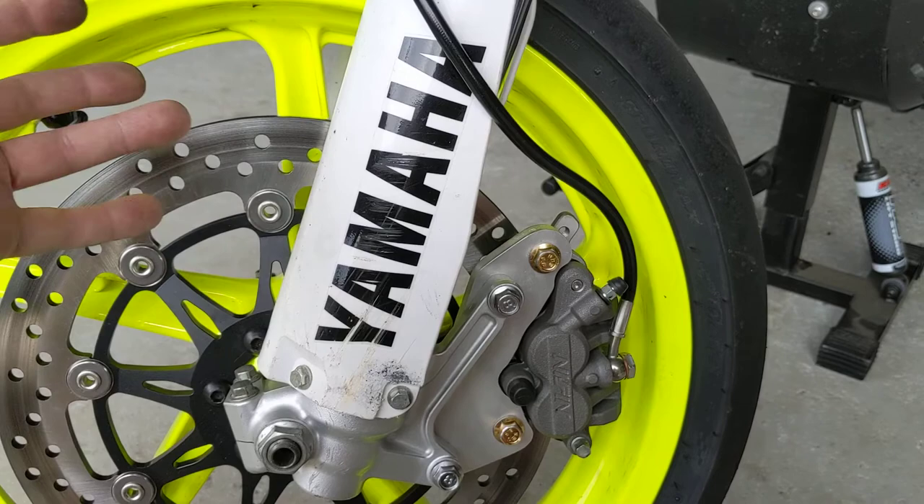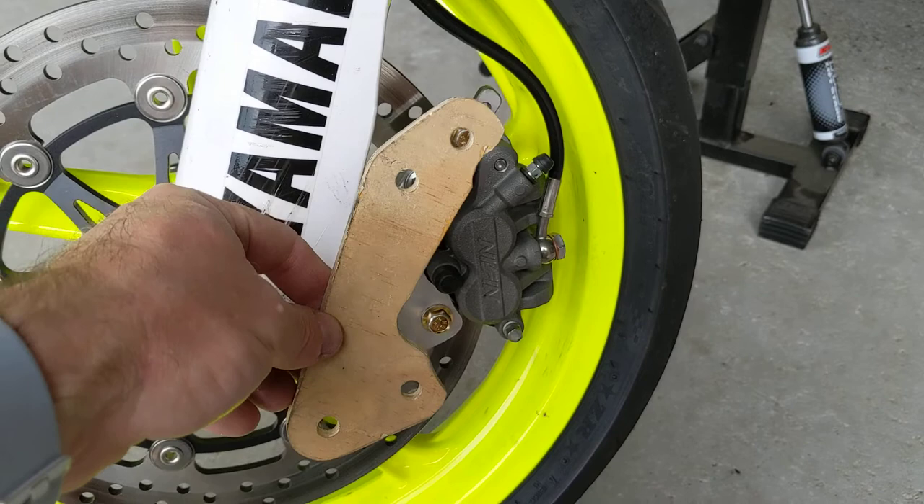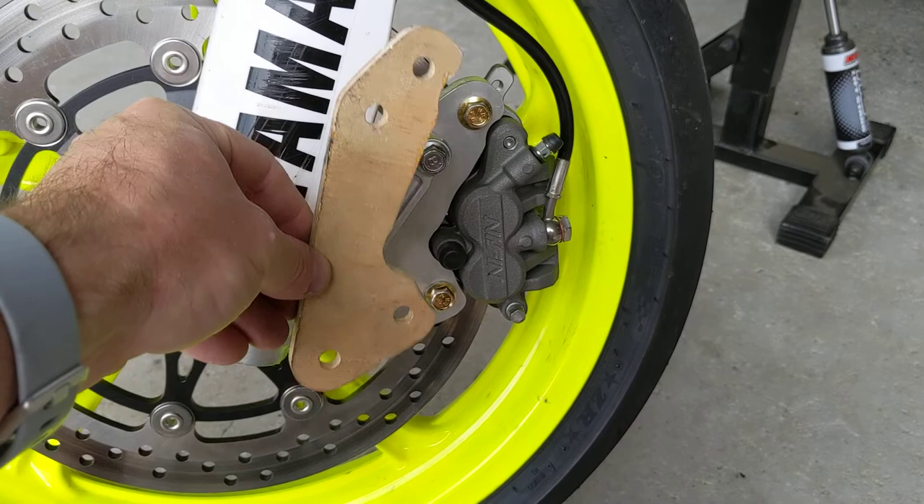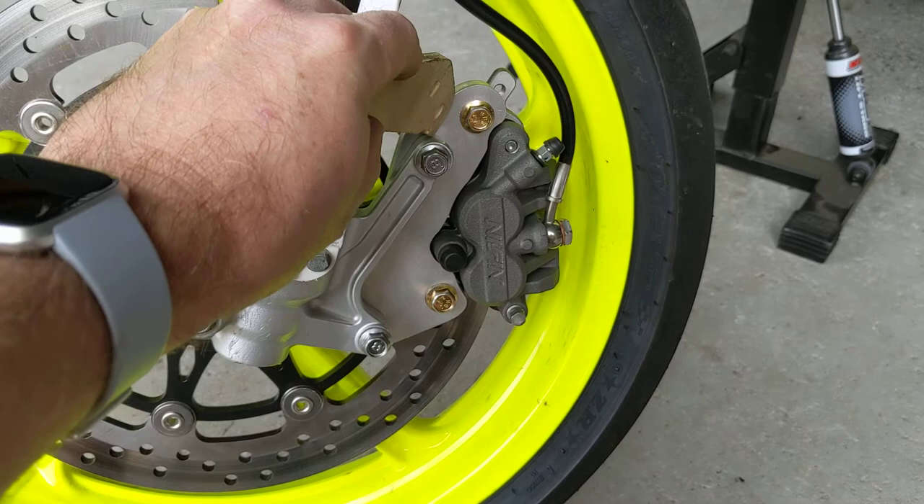For building the caliper bracket I started out with a cardboard template — really stiff cardboard — and used that to mark the holes up. Then I built it out of timber using 6mm timber and 6mm washers to bolt it all together to confirm everything would fit. Once I was certain it all fit, I ordered the 12mm aluminium block and drilled the holes out with a bench drill to make sure they were all square.